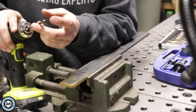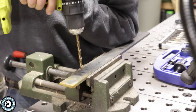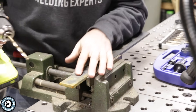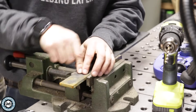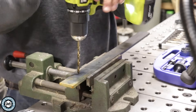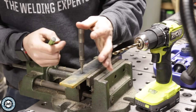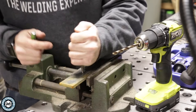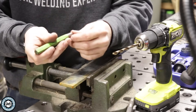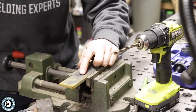When you're drilling in wood, the wood is soft enough that wherever you put the drill it's going to stay. When drilling in metal, the drill can skate across the material. So if we take a center punch and put a little punch mark exactly where we want to drill, the drill point is going to find its way into there and generally stay in that area. To center punch your metal, you can use an automatic center punch with a spring that snaps when you press it down, or a hammered center punch. In steel, I like to use the hammered punch — you set it in there, give it a tap, and it makes a nice dimple for the drill bit to register into.